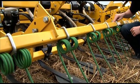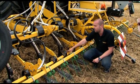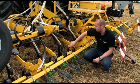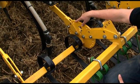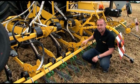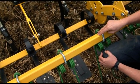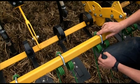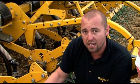A double toolbar is now available for all hybrid drills. It's retrofittable and consists of a middle bar which allows adjustment on the front section and also the rear section of tines. The rear bar has its own adjustment as well, so you can adjust the angle on all of them according to the conditions. It's also possible to have batter boards and harrows, or harrows and harrows. Customers on light soils can have a press wheel followed by a harrow, but we'd only recommend it on light soils.